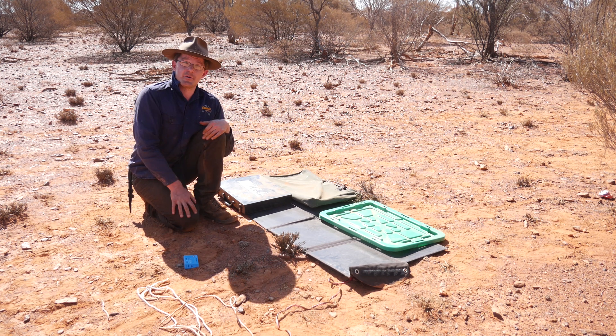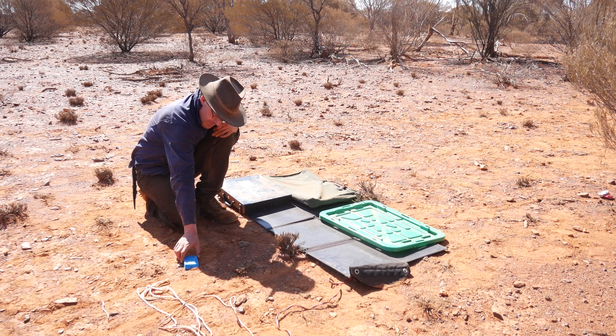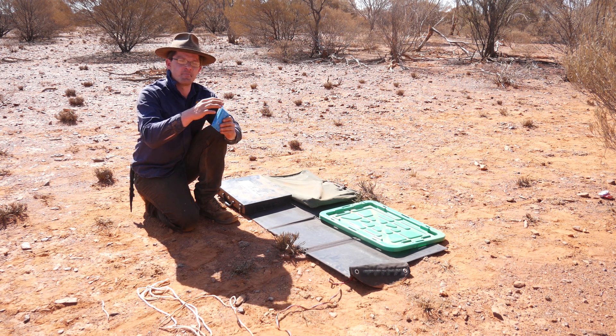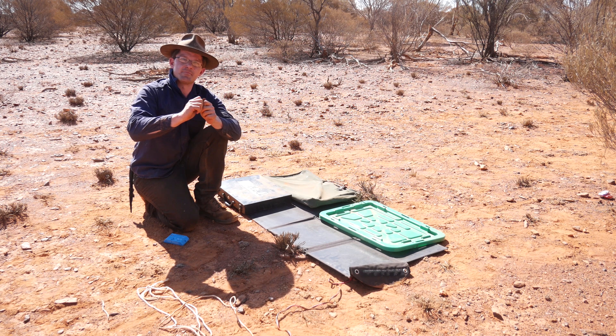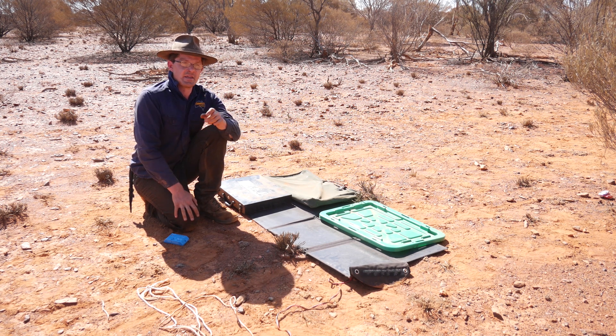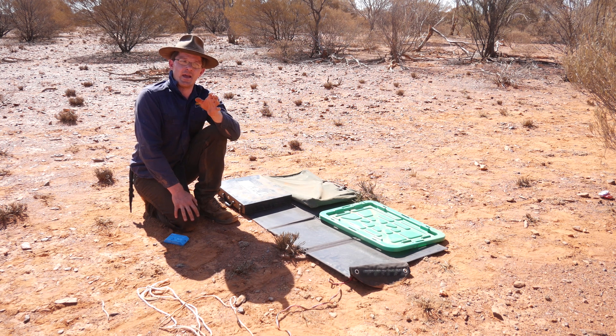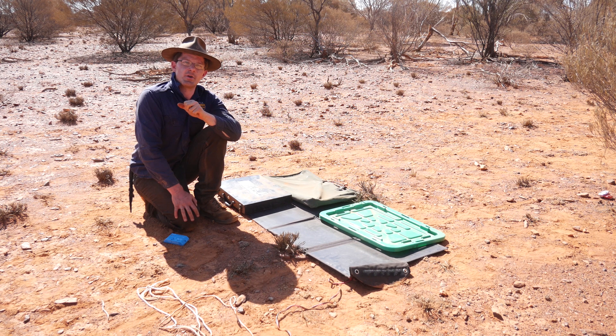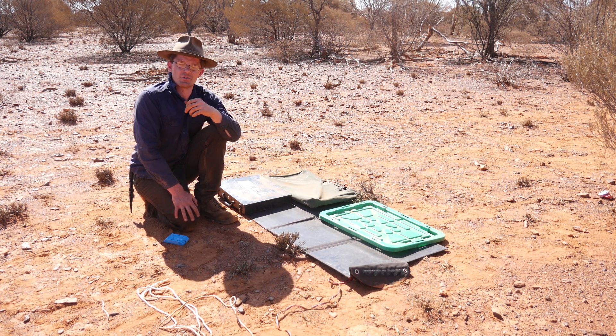And that's exactly what we've done here. We've got the wires that were going in from the solar panel and then going out from the voltage regulator to the battery. We've just basically twisted them together, put some electrical tape around them, hooked it up to the battery, and I'm using a multimeter every couple of hours or so just to keep an eye on the battery to see if it's not getting overcharged or cooked, you could say.